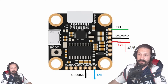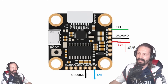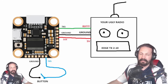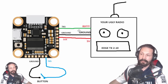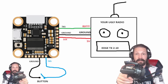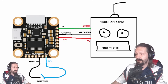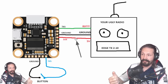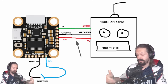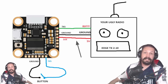If you're scared, you can power up your flight controller using the VCC pin and providing a small 2S battery - then you don't need to solder this 4.5V pin. That's actually a good idea because then you can just depower your flight controller when you don't use it on your radio. I decided to take a risk, and this is my soldering diagram. These two or three wires go into your radio into the serial trainer port, and this is how your radio will know its orientation and pass it over to your flying craft.